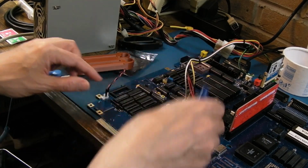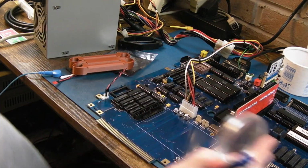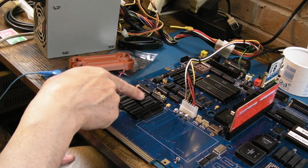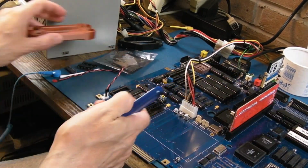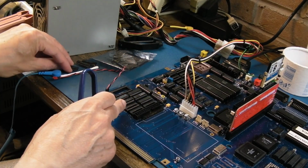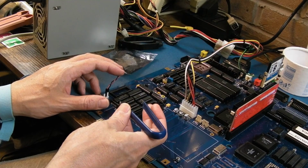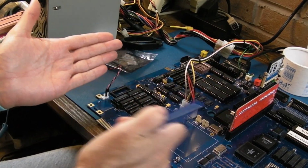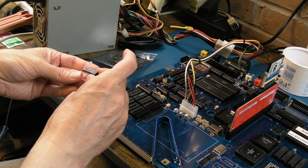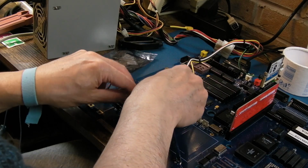You've got a pin that gives you your match, your high or low. It might just be a case of whether it's open collector or not, but that's going to be driving some of the logic here, nothing else on the Amiga. Its input is going to go to the address bus, and the output is the side that's doing the compare. You've got pins that are hardwired inputs, and then you've got the address bus, and that's just an input anyway.